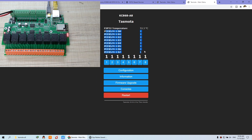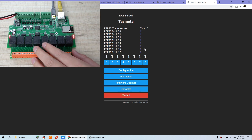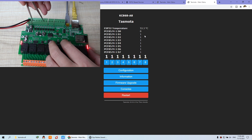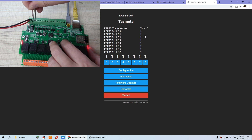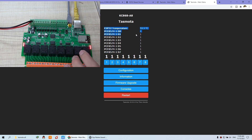You can see the state. If you want to connect a sensor, this is the 8-channel sensor input. I can use it — you can see I use it twice. This is ground and this is channel 1. If I short channel 1, you can see it triggers. This is channel 2 — channel 2 state goes to 0. And channel 3. This is channel 3. And this is channel 8 — so every input is triggered and you will see the state changes. This is how to use the relay output and the input with Tasmota on the A8 board.